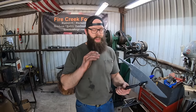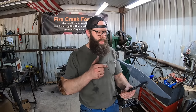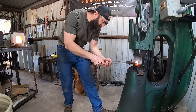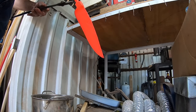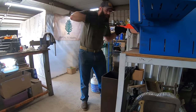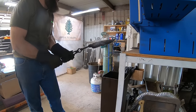There it is, all forged up. This is turning out pretty cool. I went to flip on the kiln for the normalizing cycle and it was already reading 111 degrees without even turning it on, so I'm going to stick this in to heat up for normalizing while I go hydrate. Since I have the Rockwell hardness tester now I can get some numbers on what this steel is. I used that little piece left off the end of the block, forged it down into a heat treat coupon, and I'm going to run it right alongside the blade in the heat treat.